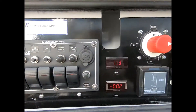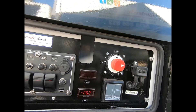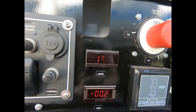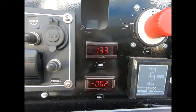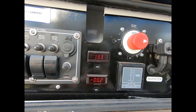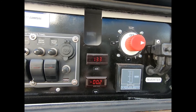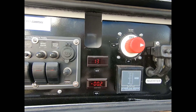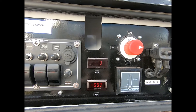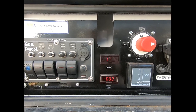Let's check the voltage here unplugged and see what it settles down to. At the moment it's 13.3 volts. With the old batteries, when unplugged, I never achieved that — it was always around 12.7 volts. I'll wait for it to settle down and see what happens.